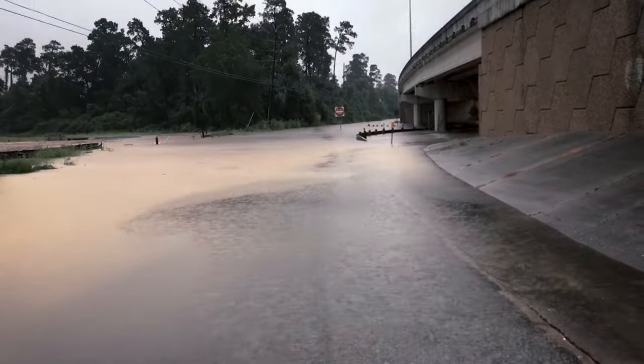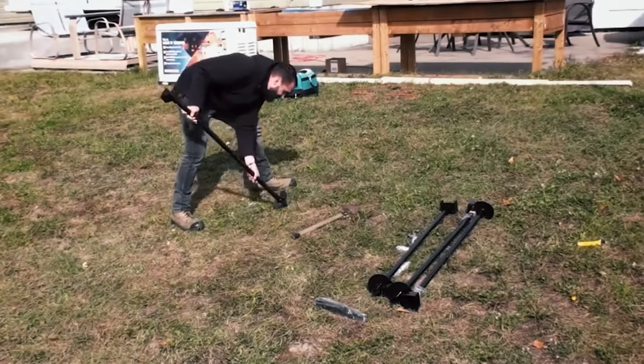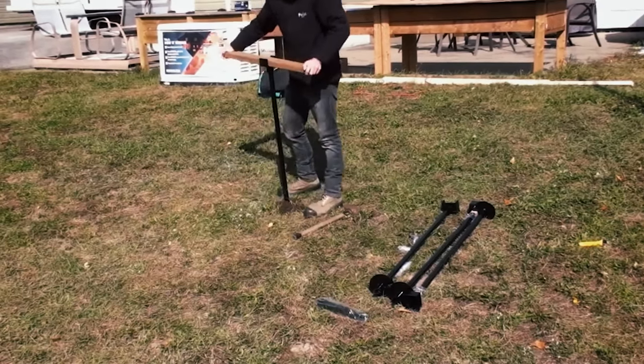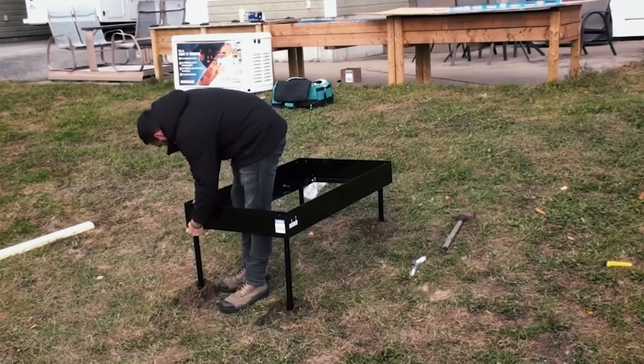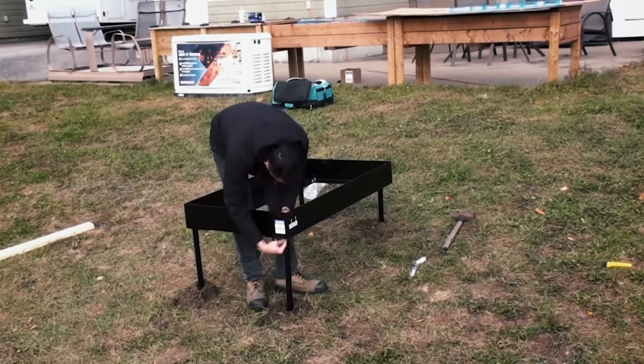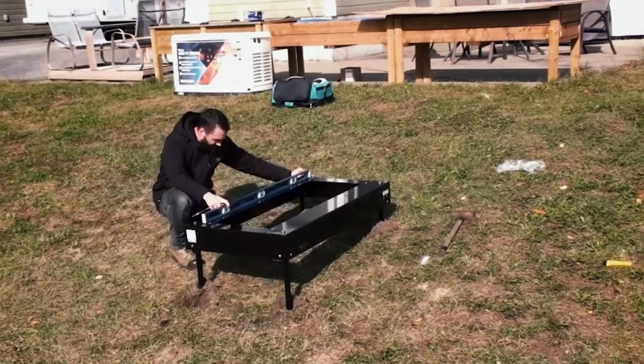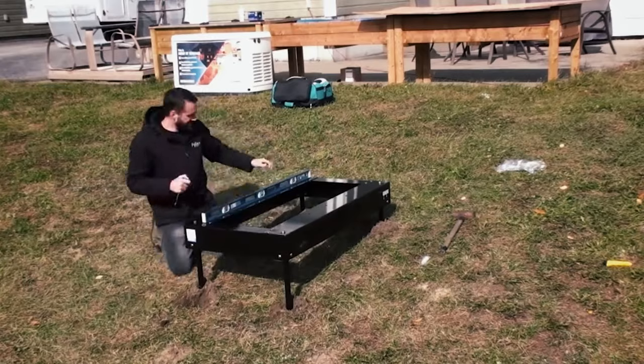There are areas that may have significantly uneven landscapes or areas that are prone to flooding. In these applications, Generac recommends the elevated stand options offered by Pylex, a preferred Generac vendor. Pylex offers a unique product that screws metal posts into the ground to create a level mounting surface. A solid mounting base then fits directly on top of the four corner posts. The base is also non-combustible, meaning that no metal flashing is required as it would have been for a wooden alternative stand. This approach drastically reduces installation time and lowers cost for the homeowner.